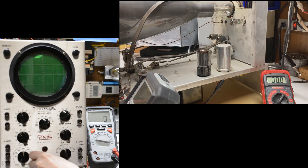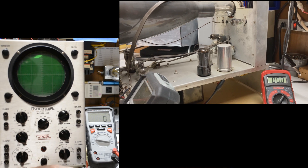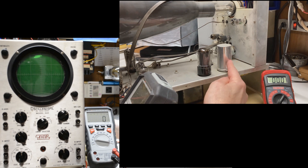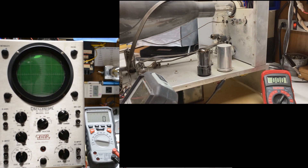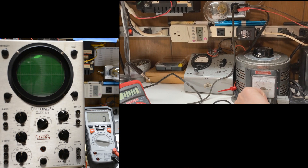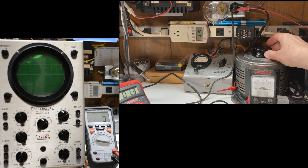We're going to turn on the power switch and turn the scale up to full bright so we can see what's happening. We've got a DC voltmeter here to monitor the B-plus voltage going into the filter capacitor, just in case something goes wrong and we need to back off on the variac. The other meter will be monitoring the AC volts going into the power cord. We're going to flip on the power switch — she's down at zero volts.